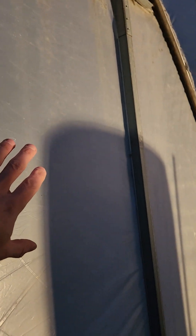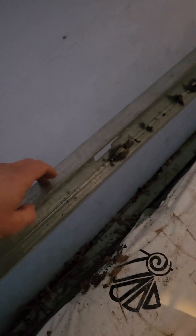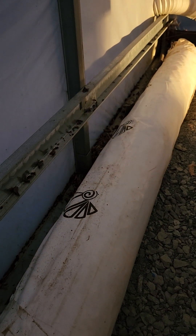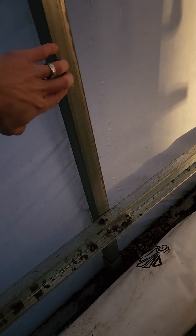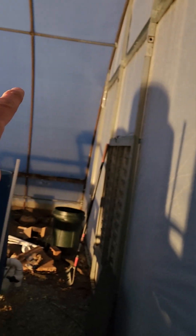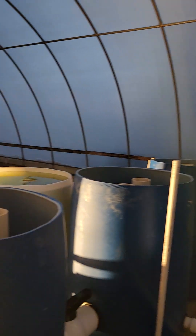This is the rear wall of the greenhouse. I use these metal studs — just regular studs for home construction, but they're cool because they don't rust and they're easy to screw to the steel of the greenhouse. These are square steel supports, so they're kind of easy to screw stuff to. I found these metal studs are just kind of nice — I don't have to worry about rot. I'll probably put a shelf up here somewhere that I can put the high-blow air pump on, and it will just bring air into all of the drums that require air.